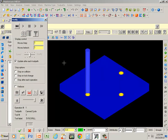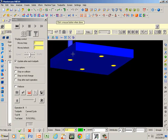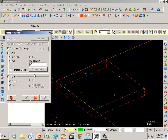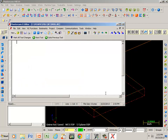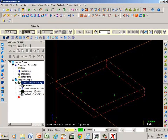It only looks like three holes drilled, but that drill is in our way. So if we hit right mouse, dynamic rotation, roll it around, look at the bottom side — it shows it drilled all the way through. Now all you have to do is hit G1 to generate the code. There's our little bit of code — it's not a long program at all. We only drill four holes. That's it.